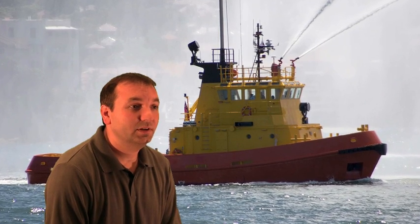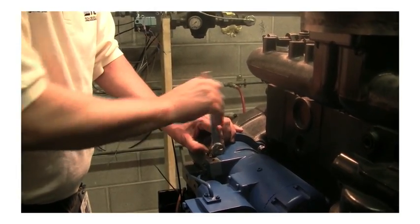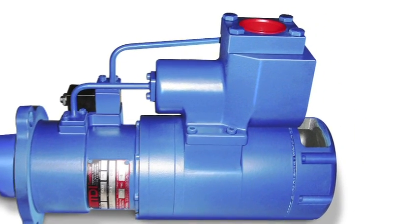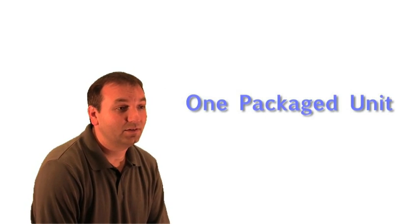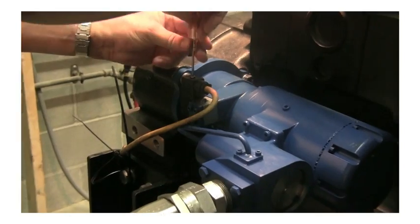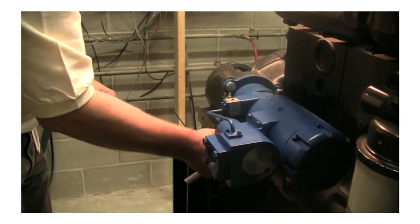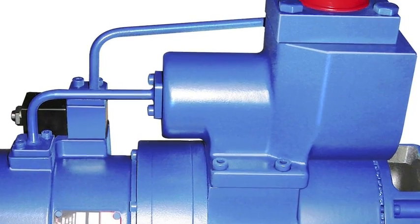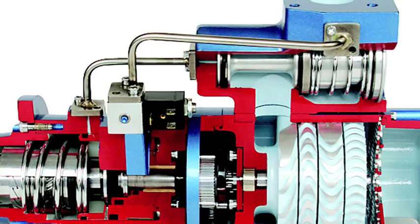One of the things that we do at TDI when designing products is we want to make them easy to install. It's the integrated controls that really make it easy to install. Typically we have the relay valve as an accessory, but in this model we wanted to make it streamlined to the starter package — streamlined to the body of it. The T25 is one packaged unit. We really focused on making it an integral system where the customer only had to do minimal hookups, and then the starter was ready to go. One of the unique features on the T25 is the rigid tubing from the relay valve to the starter, which makes it a nice streamlined package.